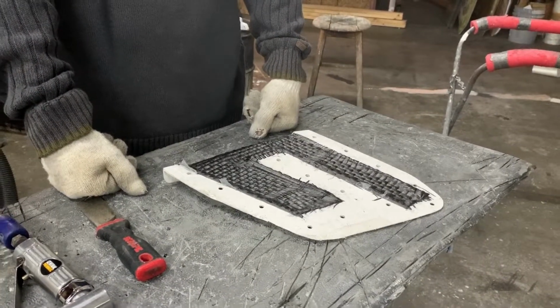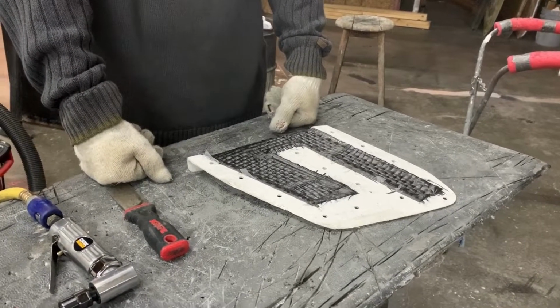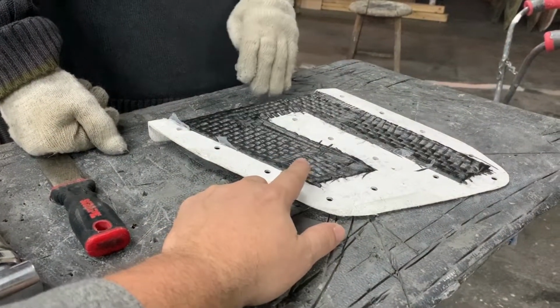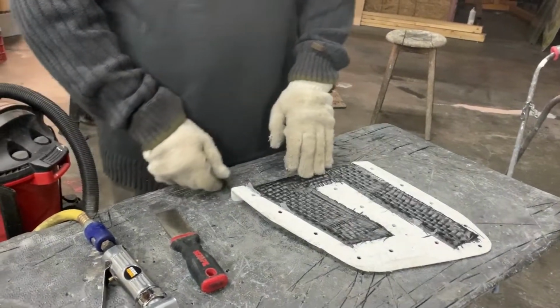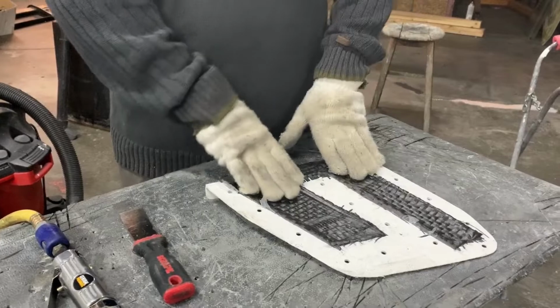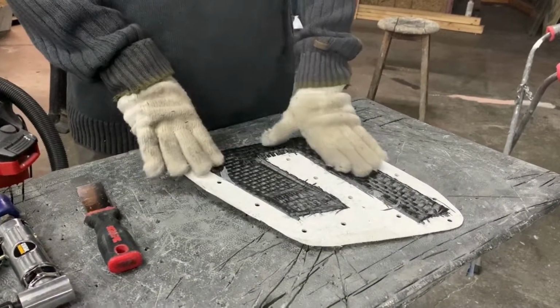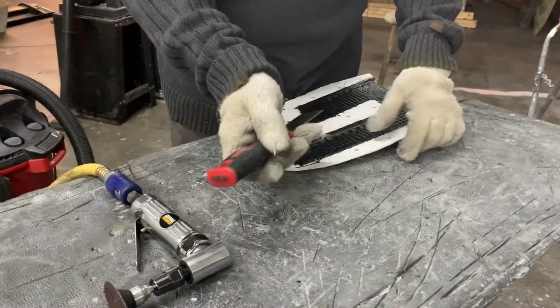So the molds have come out of the bag, and now we've got all the extra layers off. You're saying the plastic's not on there, and what was that fabric that just soaks up the resin? The breather is off, the breather fabric and the release film are off. Okay, and the next step is just pop it out of this mold. We're just going to pop it out of the mold and start trimming it. All right, cool. Well, let's get to it.